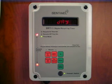Another useful feature is the test function. Pressing the test button energizes the recycle device for the amount of time you set on the recycle on time. Once the timer times out, the receptacles are turned off and the unit continues normally. The digital display counts down to the next timing event, allowing you to see where the timer is within its cycle.